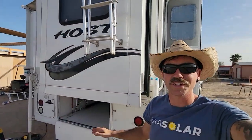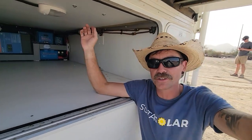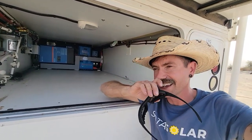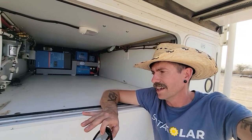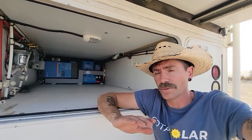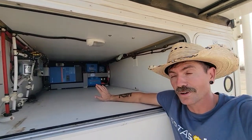All wrapped up — just finished load testing and it is cooking great. Nothing got warm. We ran the air conditioner and fired up the generator. The generator is the 2,500-watt Onan LP unit, and we found its happy spot is about 15 amps, set on the input current limit on the MultiPlus. Pushing it beyond that caused the MultiPlus to kick in and out a couple times accepting the AC signal. At 15 amps it runs really well and should be good on fuel efficiency too, since propane generators take a fair amount of propane. It fits so nice in here — I'm really happy with it.